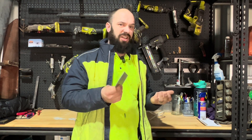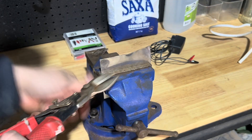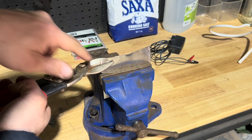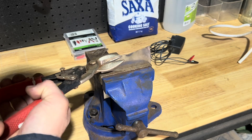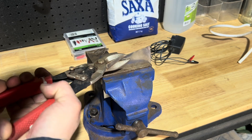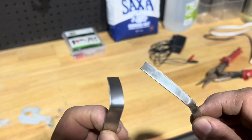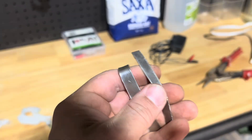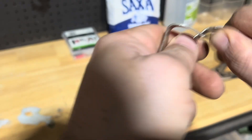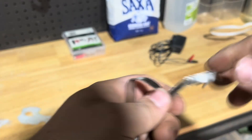We're going to start with the nickel because it's the hardest one to get wrong. The first thing we're going to do is cut our anode into strips — about this much, I guess. It doesn't really matter, especially if you're using an anode as thick as this. You'll need two strips of anode for about 10 mil. The main thing is that you can bend them on the ends to hang over the containers, which we'll do next.